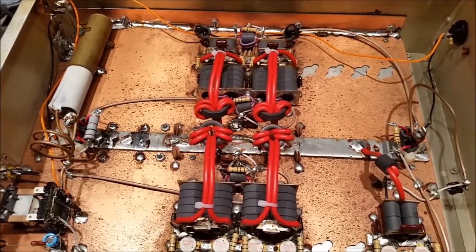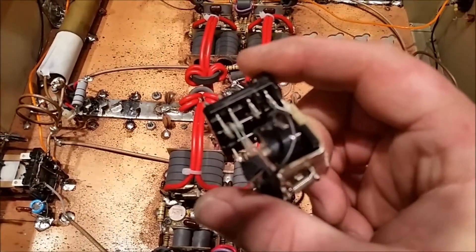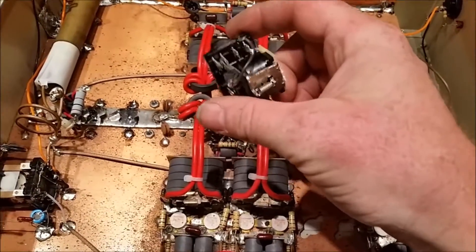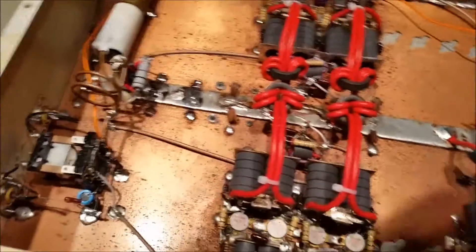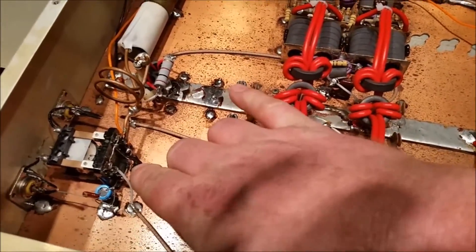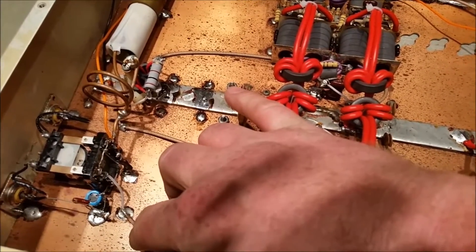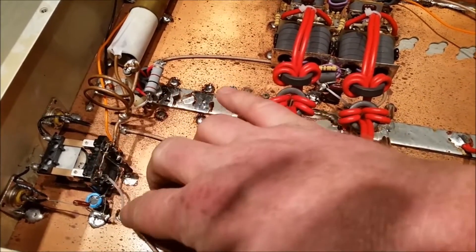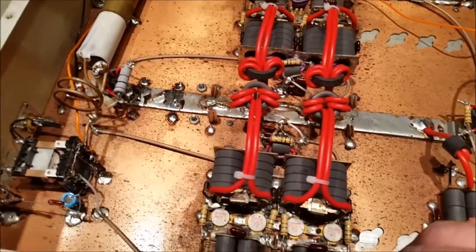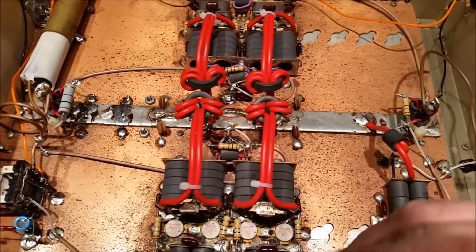From there I was polishing up the stuff that had been worn out. I had to replace this unbelievably corroded relay. I put a new one in and added a protection diode — which Dave doesn't really like to do — across the positive and negative terminals of the relay. That takes out a hard voltage spike that can knock out the transistor that keys the box. I also put bigger power wire in it.